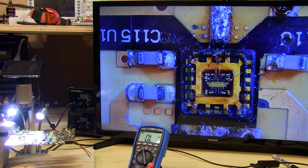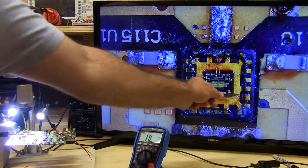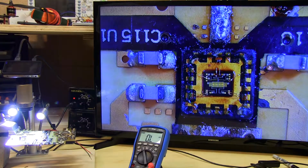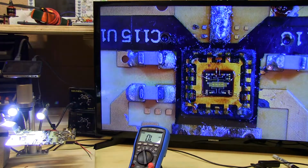Now, to verify that the chip has been flowed correctly, we'll just do a quick ohm check. By design, the 3 RF leads here, here, and here should read anywhere between 4 and probably 9 ohms. And each of these bias connections here should read somewhere in the 20 to 25 kilo ohm range. So let's just ohm those out right now.